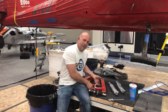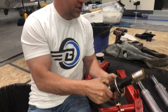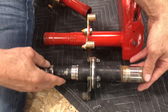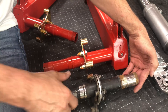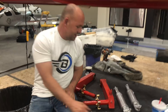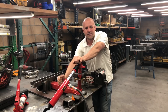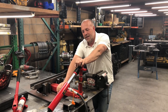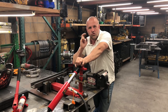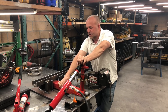This was a lot - one of those jobs that just got bigger and bigger. I machined some new axles; these are the originals. If you line these up you can see the length difference - I added over an inch of offset so I could clear the 35-inch tall tire. Right here I've got the Wilga trailing link suspension arm. I'm upgrading the axles to handle a dual brake system on my Wilga and to get a little more offset on my 35-inch tires.